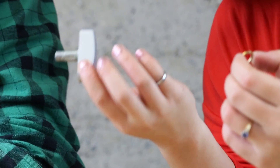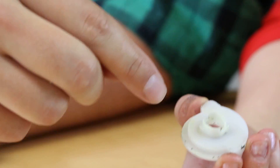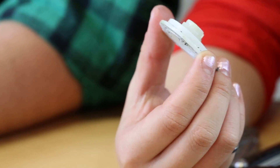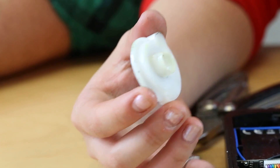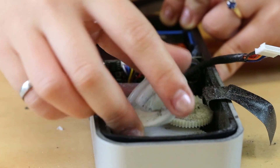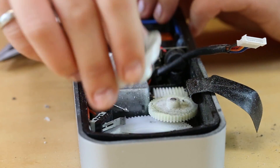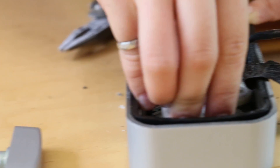There we go - that's a beautiful looking piece. The patented mechanism right there - it's this diamond shape, rounded on one side and pointy on the other, and this spring mechanism here. It essentially lets you drive it past and then still use your hands to turn it back. It's basically a clutch mechanism that gives you enough tension to lock and unlock the door, but can be manually overridden with a key or button.